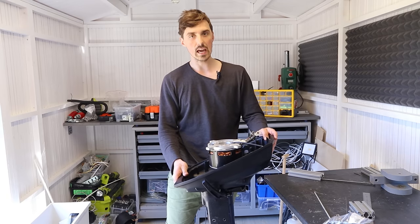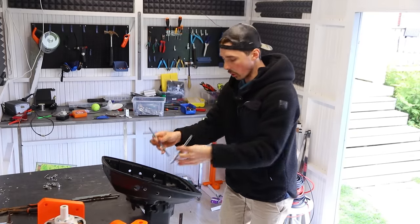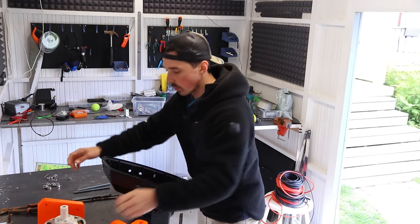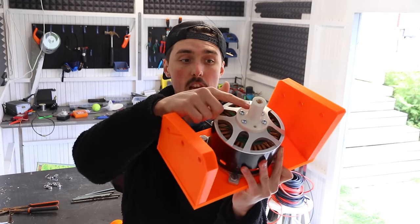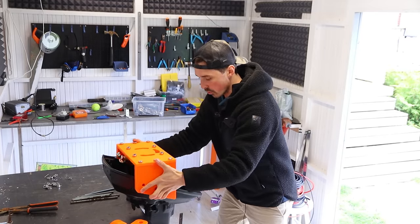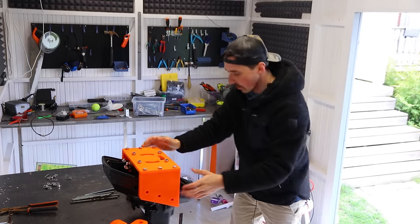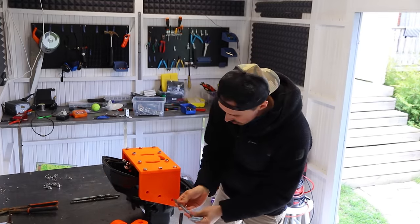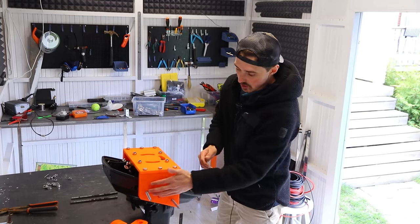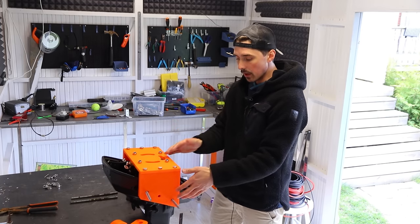I was originally thinking of using threaded rods to hold the motor in place, but I don't think that's a good idea given how tall it is — it probably couldn't support the twisting motion. So instead I 3D printed solid mounts for the motor with pre-drilled side holes so the motor clicks right into place onto the shaft. I'll then use threaded rods to support the sides. What's a bit sketchy is heating up this portion of the plastic very carefully so the sides that don't match up can be squeezed together while it's malleable.